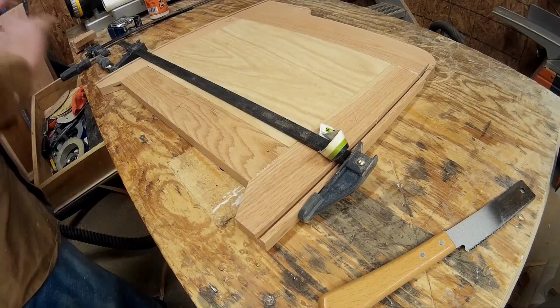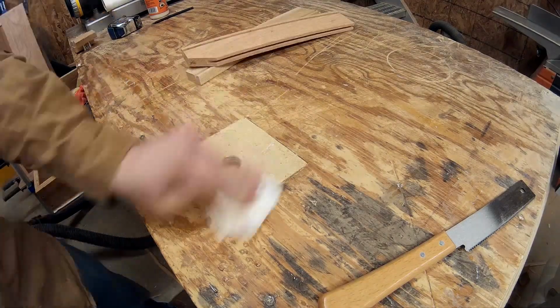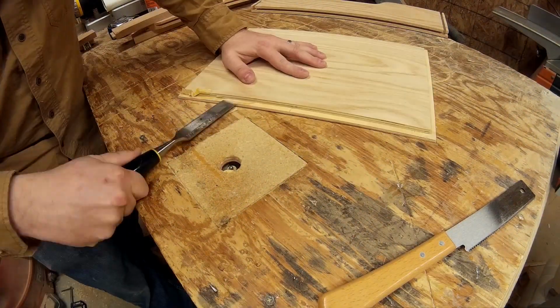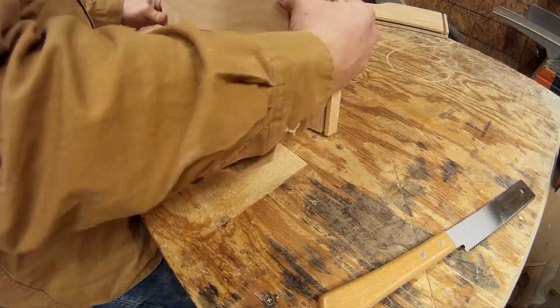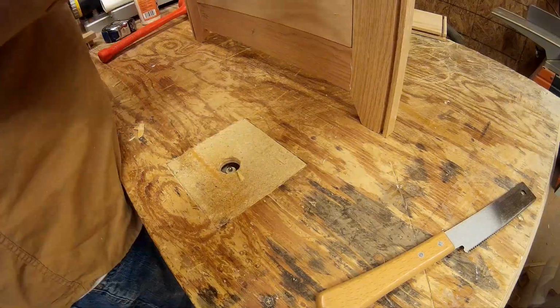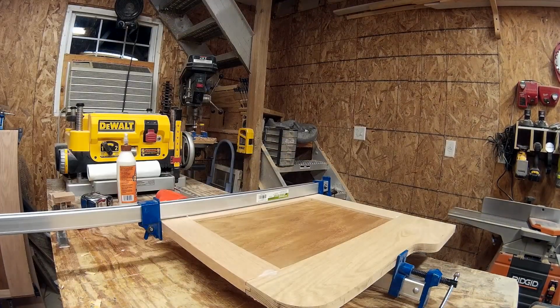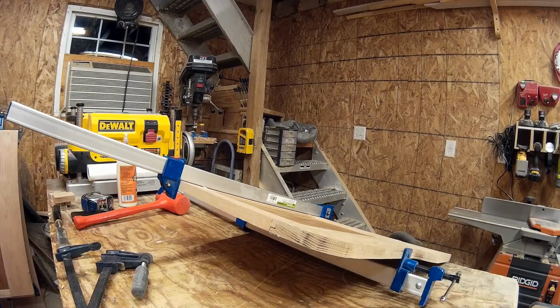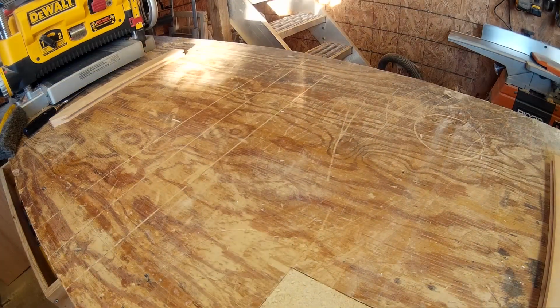And you'll see me test fit it there with the stopped dado that I made on the arm piece. So it's glue up time. I'm starting to glue up the panels. So these are the 2 side panels here, and I'm just cleaning it up a little bit so everything will fit perfect. And I glue it up and I clamp it. Next comes the front panel,